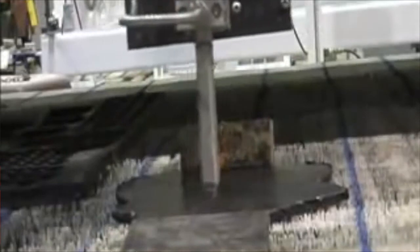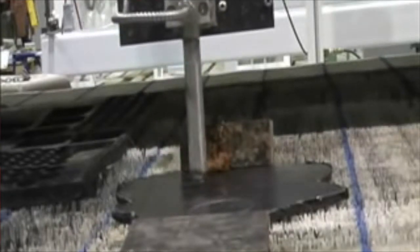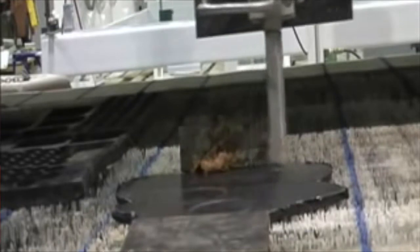So what is a water jet? Well, we use the term water jet loosely. A pure water jet is just water that's been pressurized up to 90,000 psi with a special hydraulic pump. That pure water jet can be used to cut everything from food to carpet to rubber gym mats. Anything that's soft can be cut with just water. Now, if you add an abrasive to that water, the same material that's on sandpaper, an abrasive called GARNET, you can machine virtually any material you can think of.